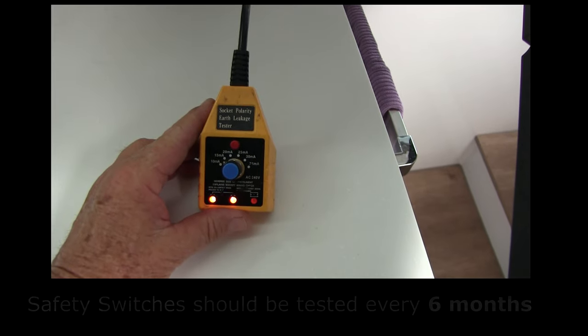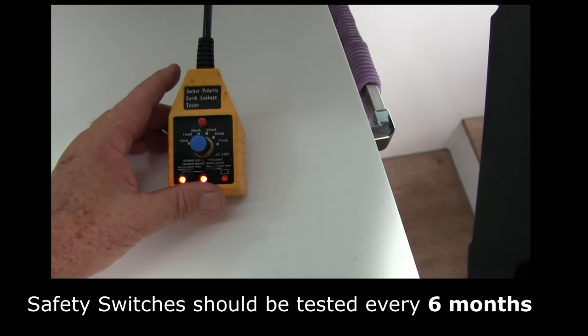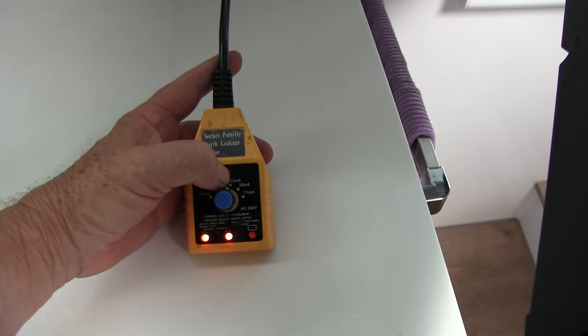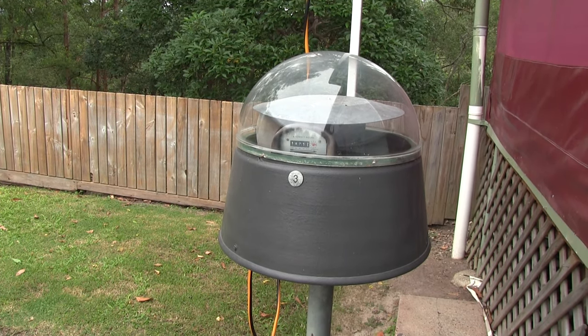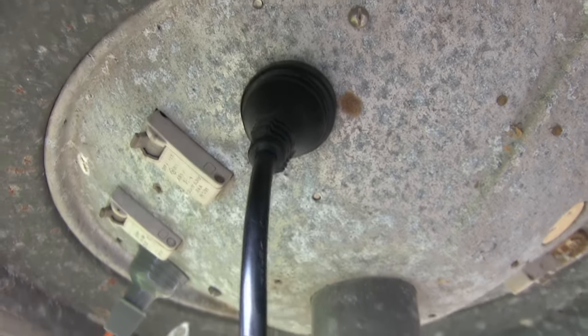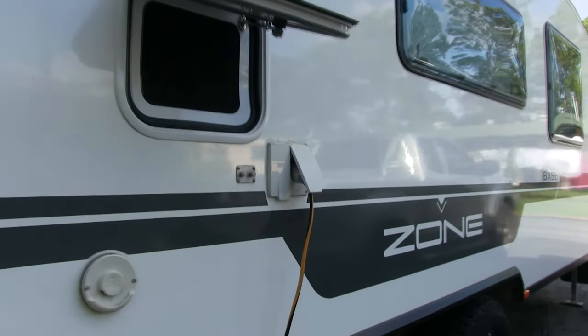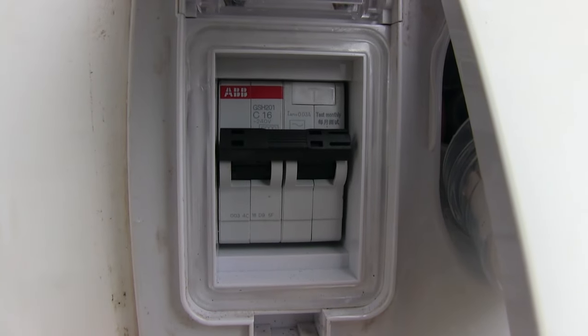Safety switches should turn off at no greater than 30 milliamps — a lot of them turn off at 25. You can regularly check your safety switch with this device: just select 230 and press the button, and your power should go off. If it doesn't go off, there's something wrong with your safety switch. The first place to check when you've lost power is the power turret where you're plugged in. Just plug the power tester into the power point — if there are no lights, you've got no juice. Check the circuit breaker, flick it back on, and you're powered up again. There's also a circuit breaker for supply into the caravan — if it's in the down position, flip it up and power is on.